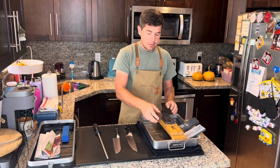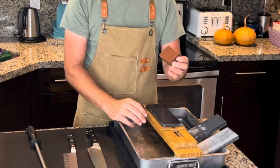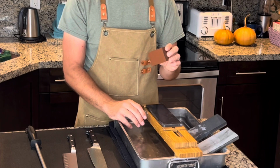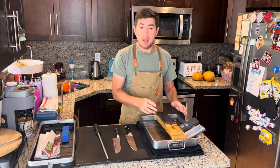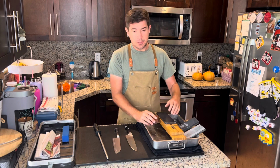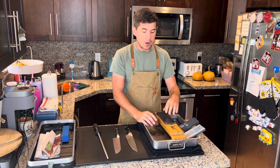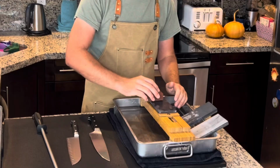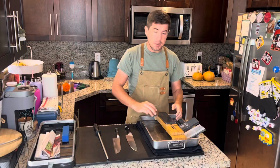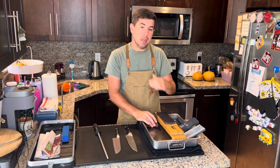And this over here, every time you lay it down or if you're getting ready to sharpen, is a block planer, to be able to even out your stone, because when you sharpen, sometimes you'll sharpen in one position for quite a while, and what happens is that it leaves little small indentations inside the block. So what this does is it helps plane the surface out to be level, and that's what you want, to get that ultimate edge that you're looking for.